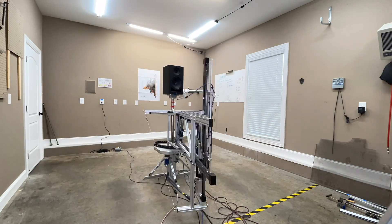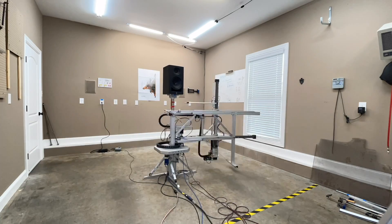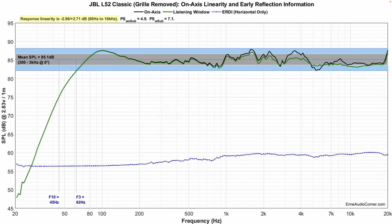Let's talk about the data. The data is captured using the Klippel Near Field Scanner — a state-of-the-art device that allows me to get anechoic data in a non-anechoic room. All of the data is taken without the grill on. The frequency response is within about plus or minus 3 dB, so in terms of the overall bandwidth it covers, that's okay. But the issue is it's bouncing around — there's a peak from 1 to about 2 kHz, then a dip around 3 kHz, then another peak from about 3 to 4 kHz, then a dip around 5 kHz, and then it flattens out.